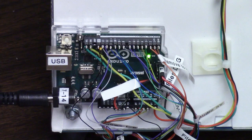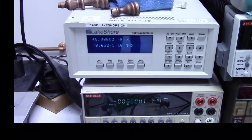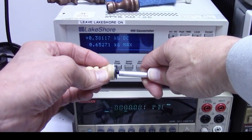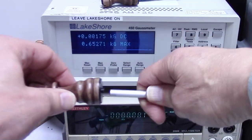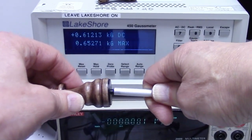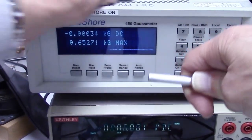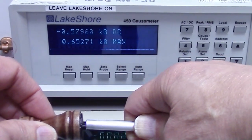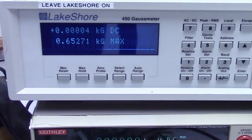The GMR sensors are sensitive enough to detect even basic magnets with a lot of latitude. They accommodate a wide range of magnet strengths — 380 Gauss, 610 Gauss, and negative 580 Gauss. The sensors are activated by positive or negative fields, which is essential since the magnet orientation is random.